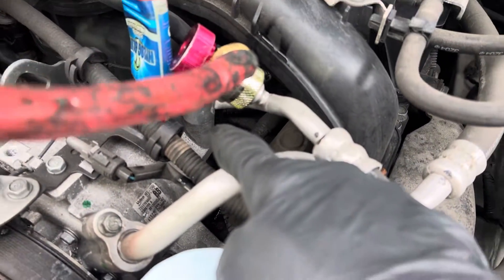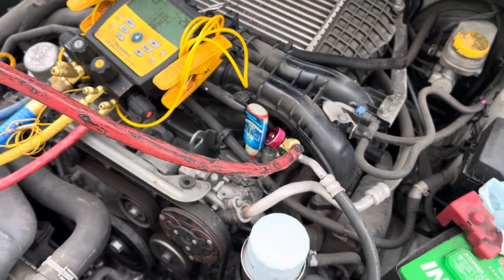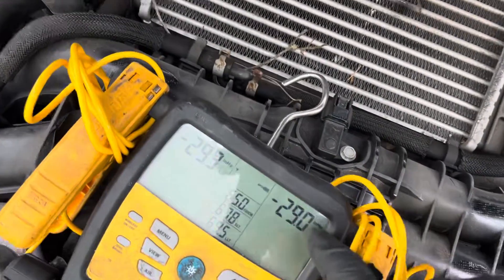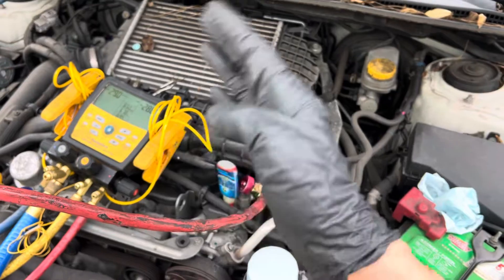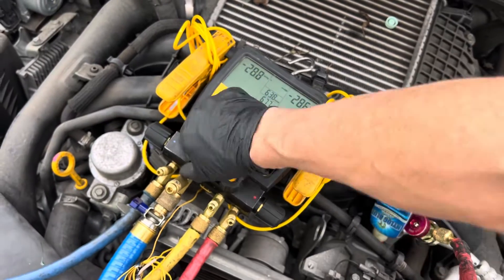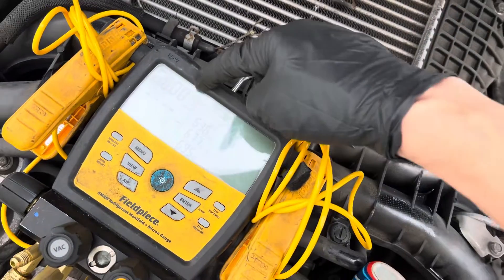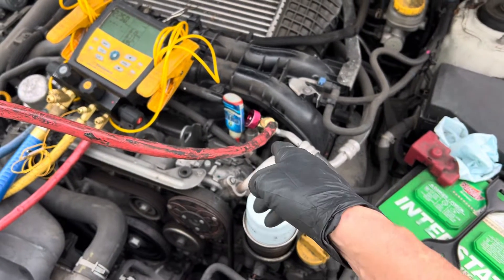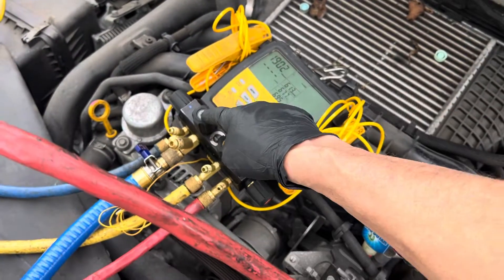We lose our vacuum and it just kind of holds right there because we know it's leaking at that o-ring. If I put high-pressure nitrogen in it, it actually blows out. With high-pressure nitrogen I showed with the refrigerant leak detector that it was leaking right there. But look at the vacuum that was holding — you could barely read it. It wouldn't be fast on the analog gauges but it's instantaneous with a micron gauge. Open the vacuum again — boom, right into the micron range. That vacuum leak leaks huge under pressure but barely leaks under a vacuum, though it does bleed off.